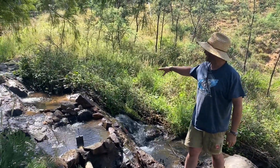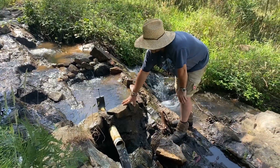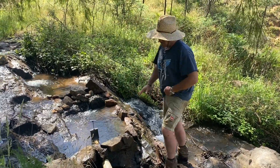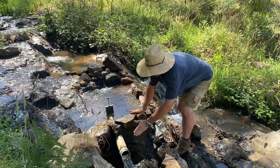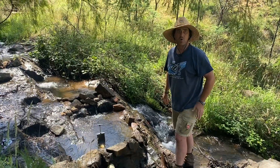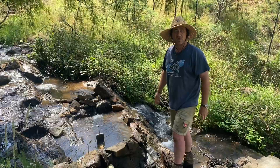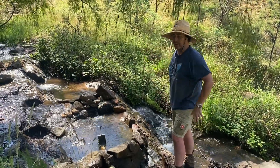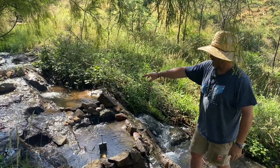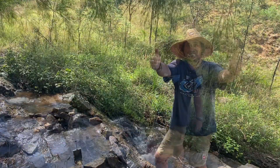We've put a few little diversions in place on the stream and I can now see our solid wall from the original take-off. We'll let this dry a little bit and then I'm going to start cementing and rocking this wall up a bit more, keeping an opening section where we can have a plate coming into a collection box. With the gate valve open everything's going to work pretty well, so I'll get some mortar and cement mixed up and start laying some blocks. Hopefully in a couple of days it's all dry. I'll have to put some overflows in place — one at either end where that natural course is going, and maybe one on that side there.